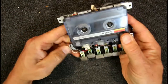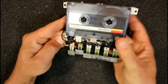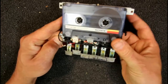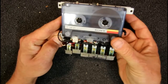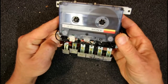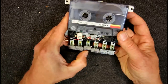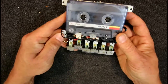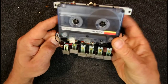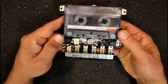There are actually two gears stacked with a clutch — the lower one slips. I initially thought that was just for when the tape reaches the end during fast-forward or rewind, but it's not flying through in play mode. Eventually we'll reach the leader at the end of the tape and it'll jam, so you need a little slippage before the auto-stop kicks in. The tape stopped completely and then the auto-stop kicked in — so I assumed the clutch was just for that.